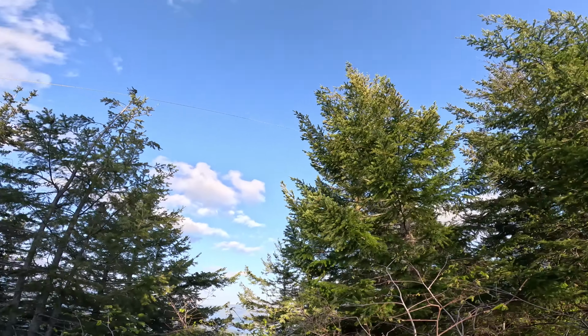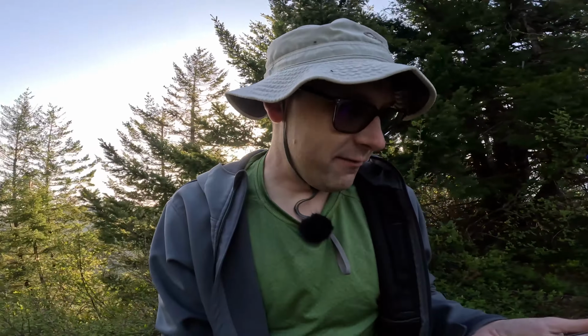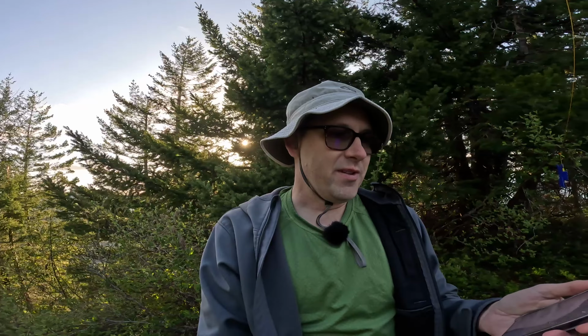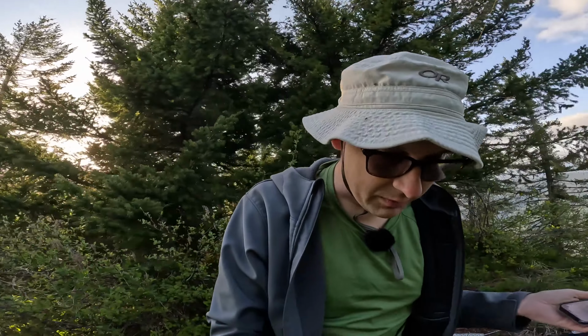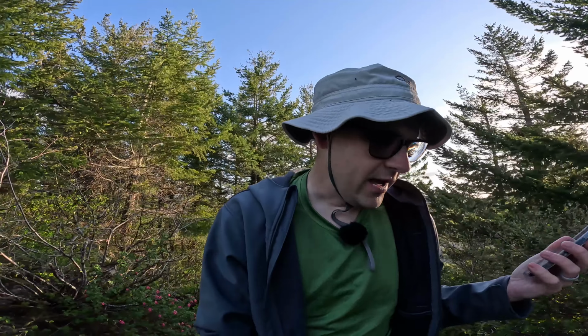It's running against branches. And it's still working. I've got cell phone service up here, so I was hearing from people on Slack who were trying to work me, and they told me that whatever I did made a huge difference. In fact, my first 40-meter contact, November Romeo 7 Yankee, told me whatever I did with the antenna made a huge difference. With 40 meters, that makes total sense. I was probably benefiting from near vertical incident skywave. I was making contacts into the Portland area, into California, actually a lot into California.